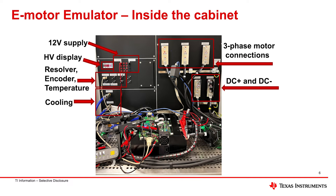This looks like a rat's nest, but it's actually not that bad. All you're really doing is looking at the outputs — you do need to provide all of the stimulus, including the motor angle, and basically everything is emulated by the hardware-in-the-loop simulator here. One person's rat's nest is another person's meticulously organized test bench.